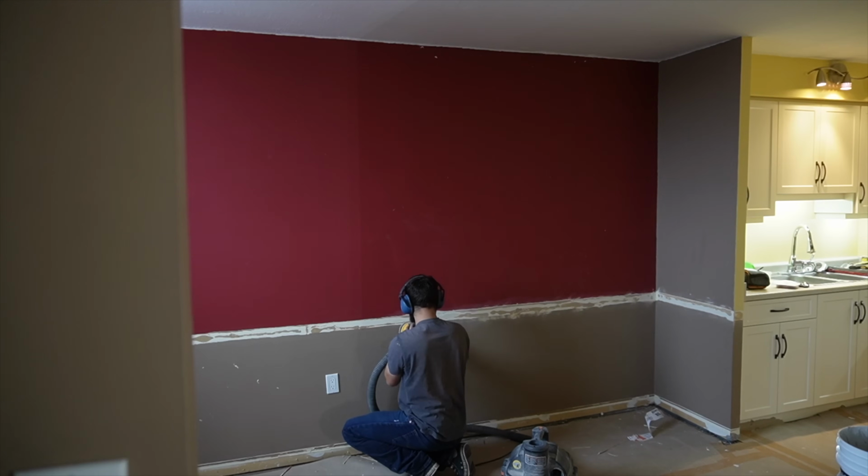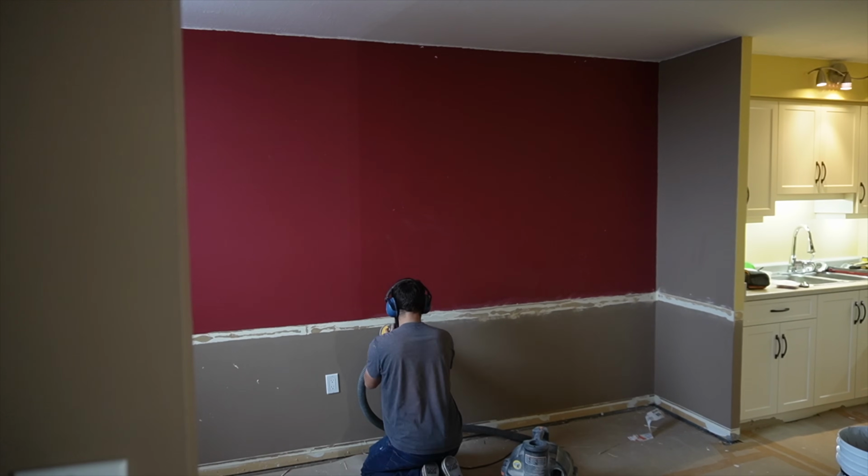condo because we needed that joint to be flat. That line is right underneath eye level. If you don't spend the time now prepping before your first coat of mud, it's going to look like crap.